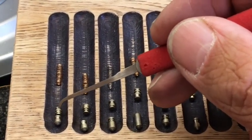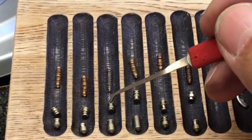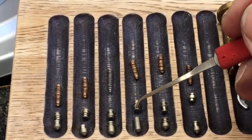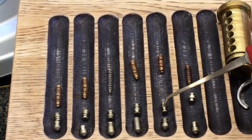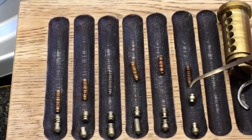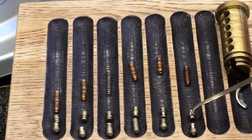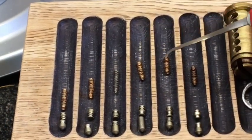It's like a serrated barrel pin in 1, double serrated in 2, a single serrated spool, maybe barrel pin in 3, a beautiful sharp serrated spool in 4, an awesome big spool, like a double spool in 5, and like a barrel pin with a serrated, with quite a sharp edge in 6. And then the springs: copper, copper, steel, copper, copper, copper.